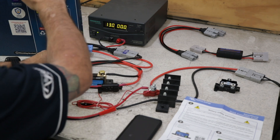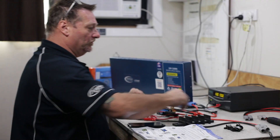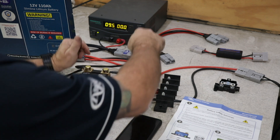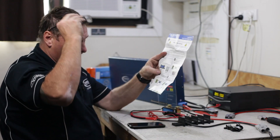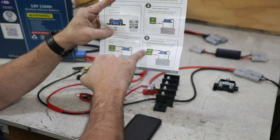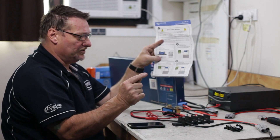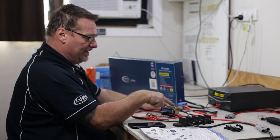Then for the output of the battery to the shunt and to your loads — in this case the grey Anderson plug. It's just one of these normal type of Anderson plugs with the terminals on one end. That will go into your grey Anderson plug. So the output for your grey, which is your battery supply — the negative would go to the battery minus symbol, exactly as you would see on the instructions that come with it. This is the smart shunt from Victron. So loads and charges go from the system side of the shunt, and the battery negative comes straight across to the battery side of the shunt. Then the positive from the loads and the chargers would obviously go directly to your positive side.